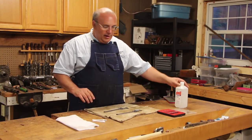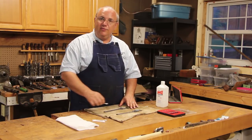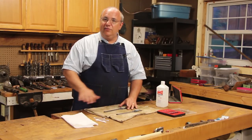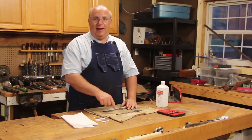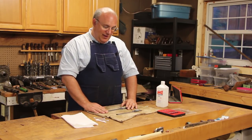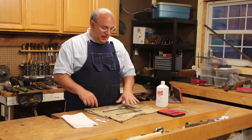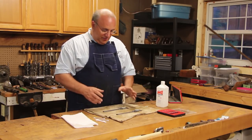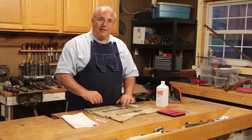For cleaning I use rubbing alcohol, Q-tips to get down in there and clean out the parts, and a paper towel and maybe another cloth rag to wipe it once you start cleaning. This set isn't bad. The set I had at the museum had gotten kind of gunky — I really didn't realize how bad they were until I took them apart. But this pair is not bad; you'll at least get to see the process. So let's get zoomed in closer and I'll show you how to take these things apart, clean them, put them back together, and get that dial set back to zero.